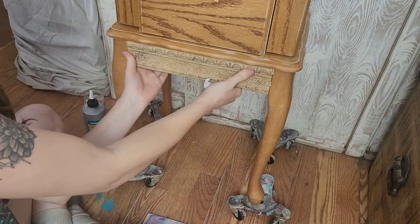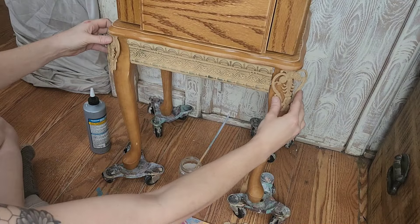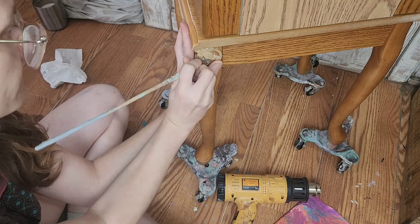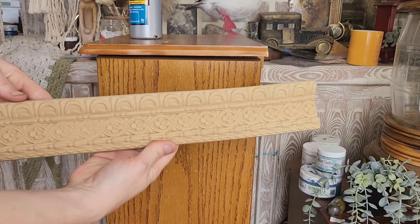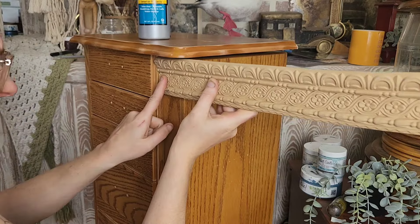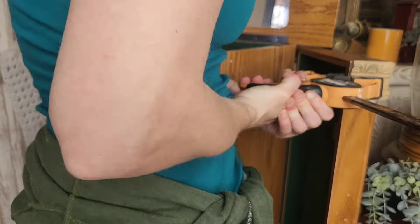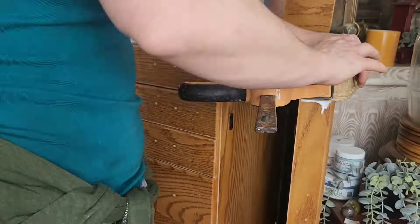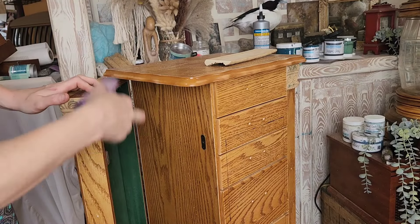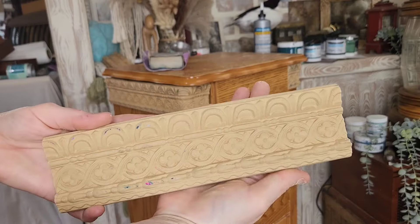Then I just went about gluing them in place with my go-to glue, Titebond Quick and Thick, wiping off any excess glue with a wet paintbrush. I'm going to be using iFlex Wood mold 2858, following the same process to heat up and glue down this product — adding one on each leg. For the top of this armoire, I want to wrap this trim around the corner, so after thoroughly heating it up I'm going to bend and dry-fit it first before adding the glue and then using clamps to secure it in place. After my glue had about 24 hours to dry, I came back through and sanded the edges so they were smooth and flush with the edge on the jewelry box door, and one more piece of trim was added to the center.